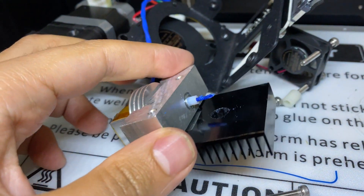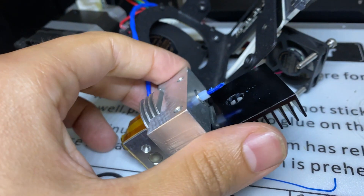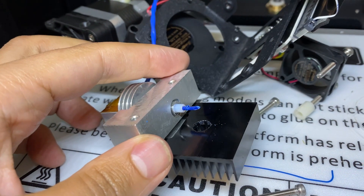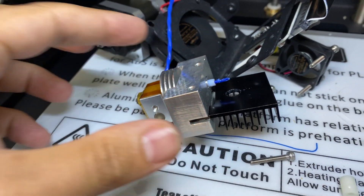The fourth thing I did not like, related to this, is the extrusion heat creep — quite bad. If we reach temperatures above 240 degrees, which is the maximum I managed, the thermal dissipation is very poorly resolved and we end up creating quite a significant heat creep jam.